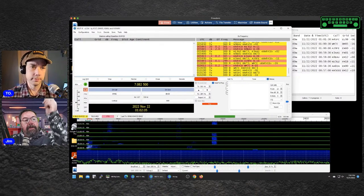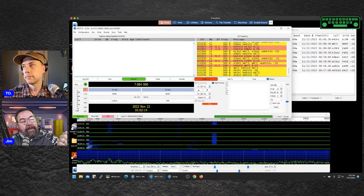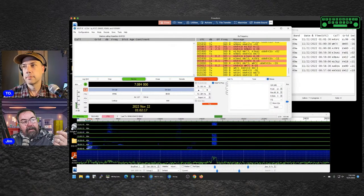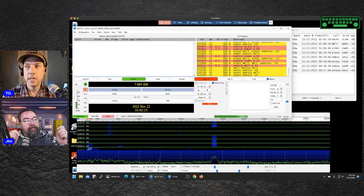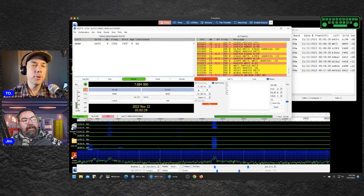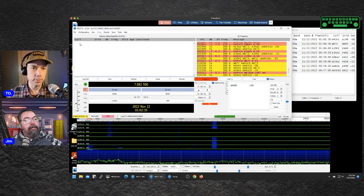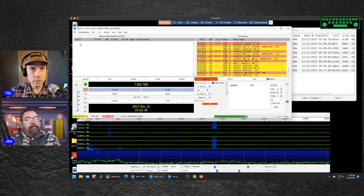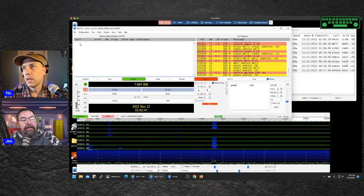Well, see, what's interesting in this, Dr. Taylor apparently is a witch who has made a pact with the dark forces. Because I understand basically how FT8 works. It just does frequency division multiplexing across the 3 kilohertz band range, right? Yeah. So this is just amazing. From the computer side of things, he's taking four signals, because this is all sound card stuff. This is all audio inside of your computer. So you're taking four different tone modulations and running them on four different segments of that 3 kilohertz. Right. That's what I'm saying. That is straight up witchcraft.